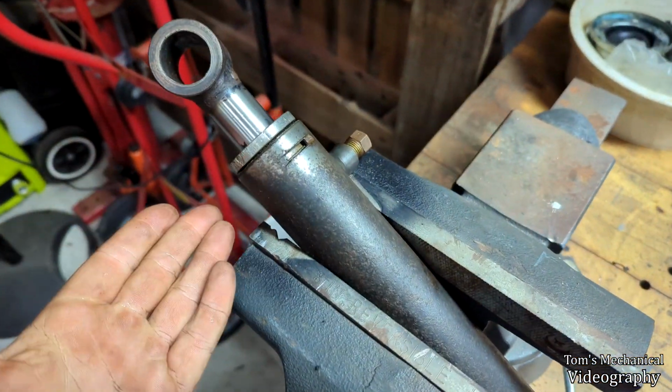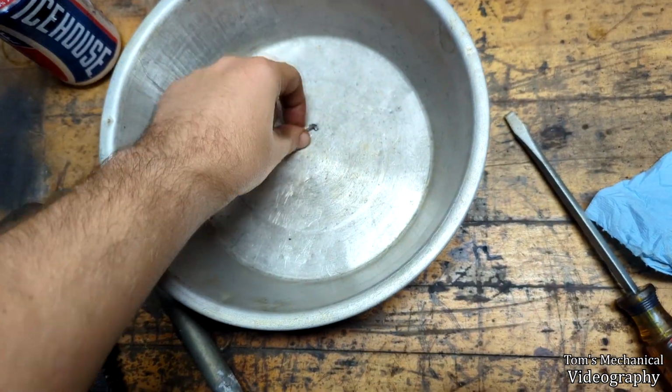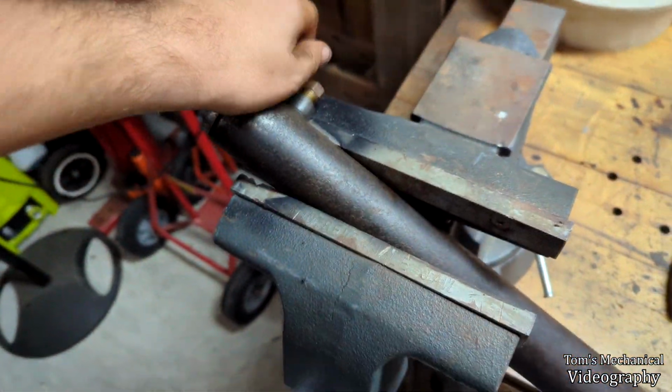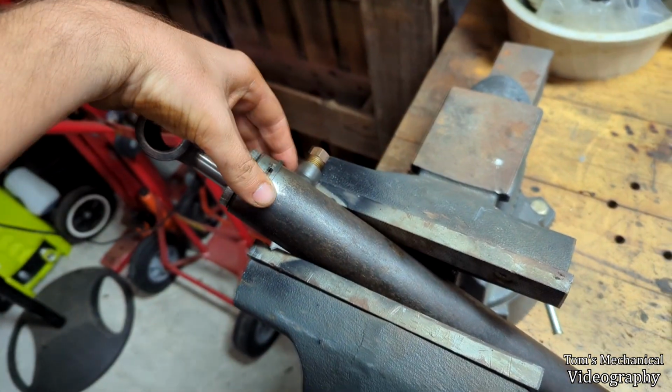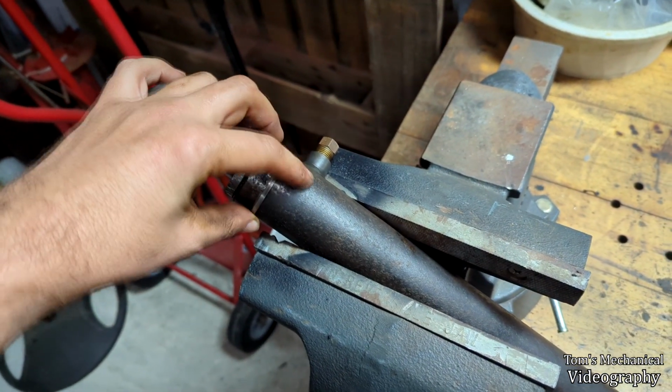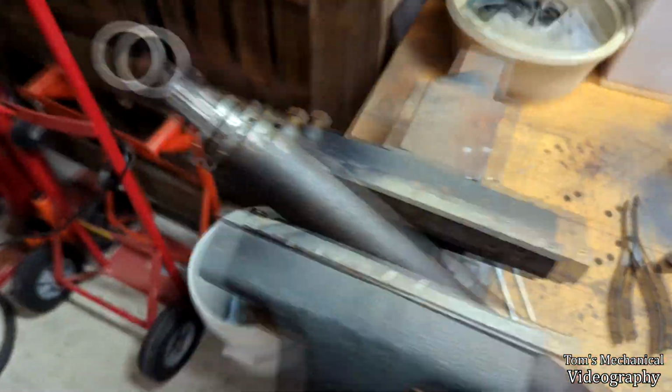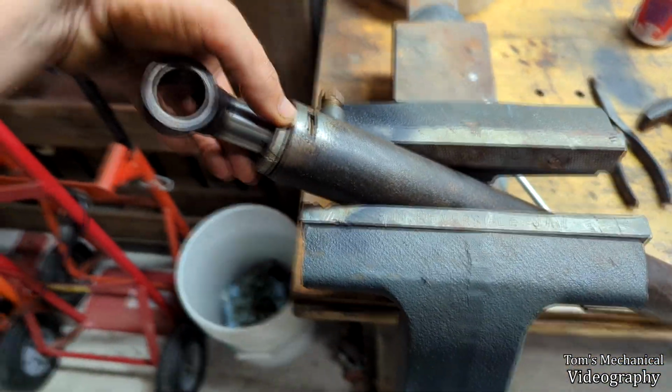All right, so I got that guy out. It's actually kind of like a lock ring. So it hooks into here, and then you just spin it, and then it rotates into place. And so it functions basically the same way an E-clip or a C-clip would work, but kind of cool. I just spun this thing with a pipe wrench to get it off. This is definitely aluminum because it chewed the hell out of it.